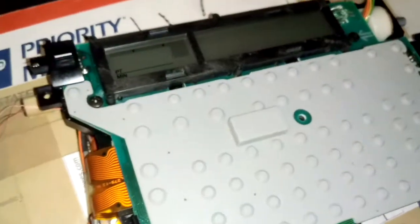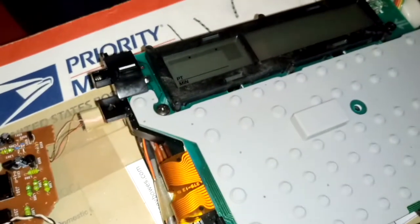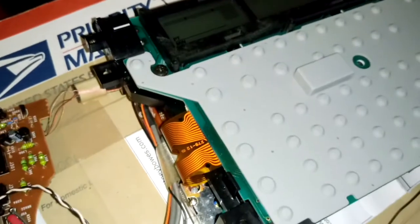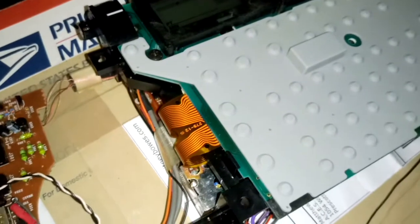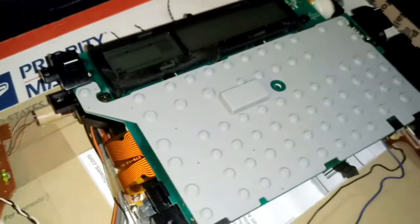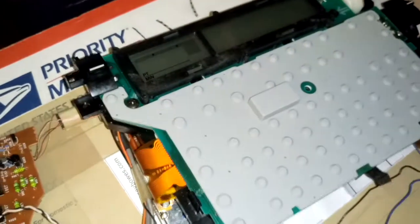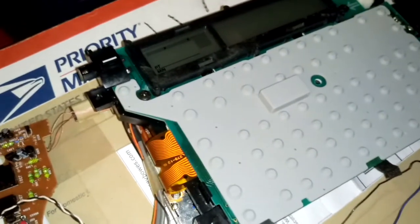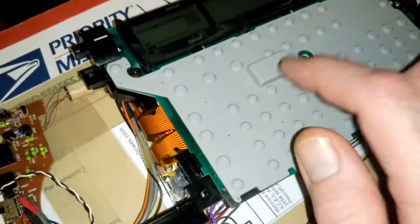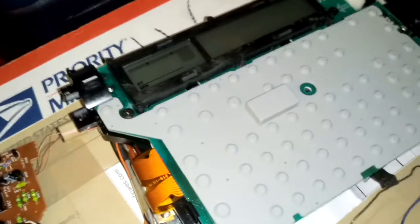When I turned it on, clicking on AM and air band — only the air band button worked, which works fine — but I need the shortwave to work too. I took off the rubber pad, sprayed everything down, and took a Q-tip with alcohol to clean each one of the little buttons. There's a noisy parrot in the background getting excited by the video camera.